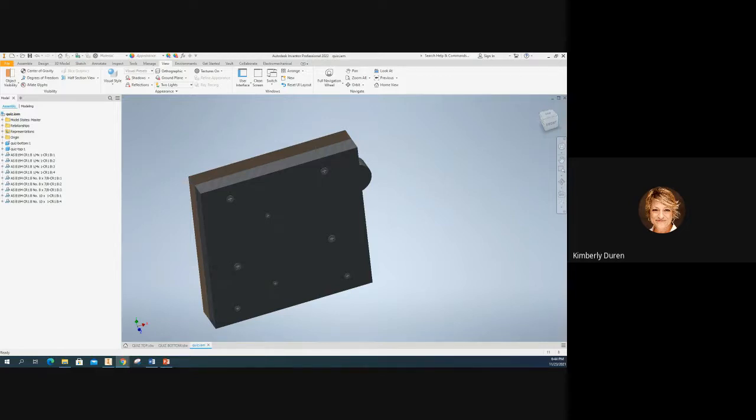We only put this on threaded holes. When a threaded hole is angled, we're never going to get that screw started and it's going to interfere with the clearance hole. The rule is: how much engagement do I have in the threads? So here's what we've got — a countersink hole.